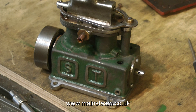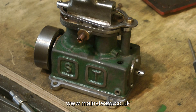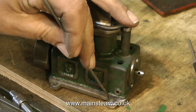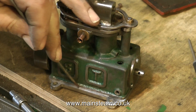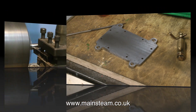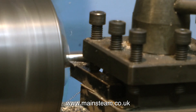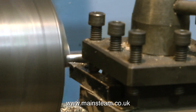This is a Stuart Sun engine with most of the green paint removed, apart from the paint that didn't remove with the cellulose thinners, which I've left in place as an undercoat. This original green paint was so well baked onto the engine, probably from years of running on steam, it seemed like a good idea to leave it where it was as an undercoat. All I'm doing now is accurately marking out the bed plate, and after machining it to the finished size I drilled and reamed four holes in the mounting lugs. Then over to the lathe, and all I had to do was turn four step bushes that pressed into the quarter-inch reamed holes, with the hole in the centre of these bushes being 5/32nds of an inch in diameter.